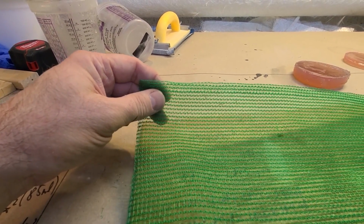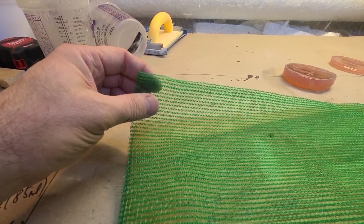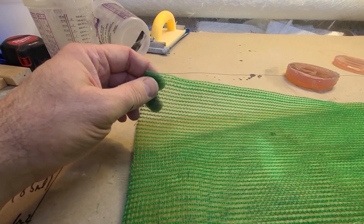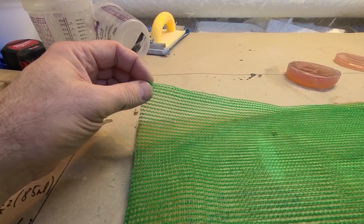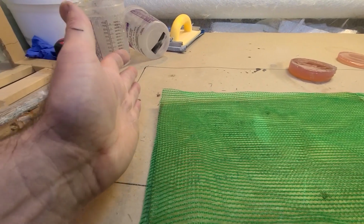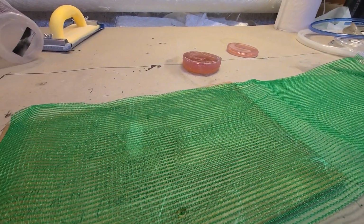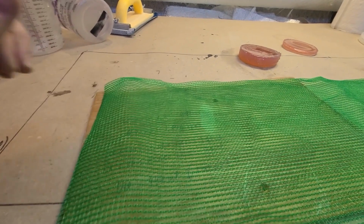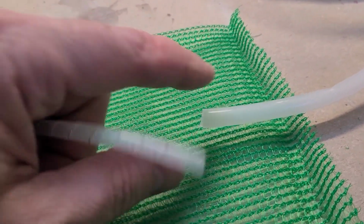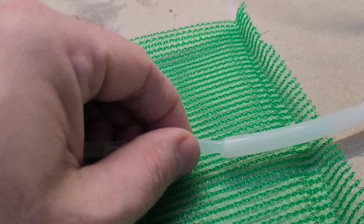Yeah, I'm sure that the professionally sold medium material has an even texture for any flow back and forth like a square, but obviously this doesn't, and it's interesting. So anyway, I cut it right away for now, and I'm planning to add the resin inflow from the left side and outflow for the vacuum from the right side, and just put one layer of this medium, and yeah, let's see, exciting.